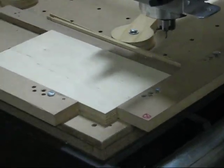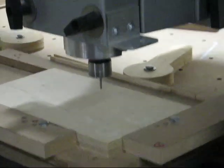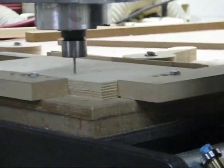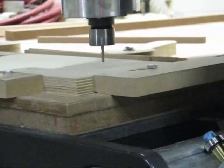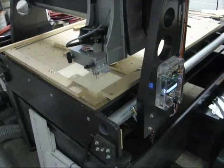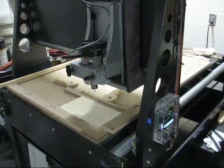It goes back to continue with the G-code — it's going to cut the same thing it cut the first time at the same position at Z zero. And that's it, that's how the tool change works with the 2010 screen set.